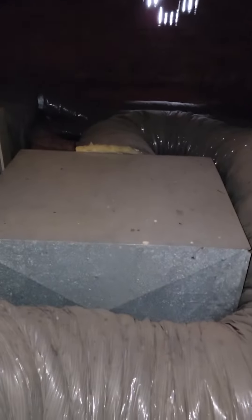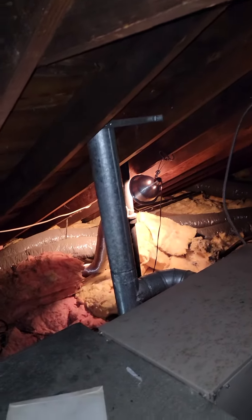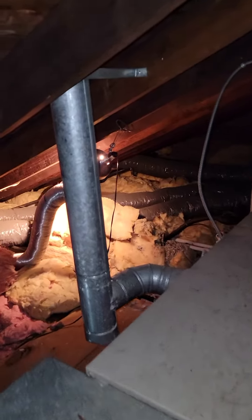There's 7 supply flex coming off the plenum, so we should just be able to replace a new furnace coil in here, everything out through the stairs that are already built in. New light, new pan, and new venting. It's going into a 4 inch B-vent.